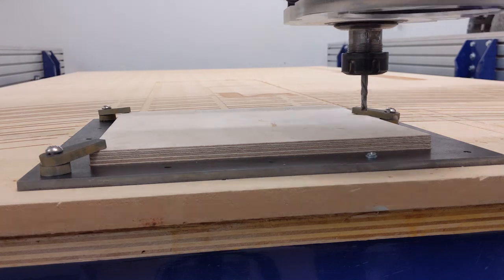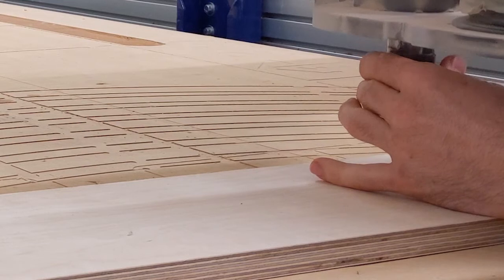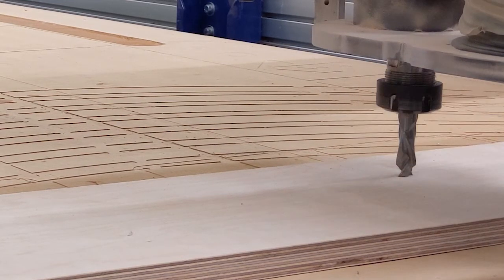For finding your XY0, adjust the position of your bit until it is above your XY0 location from your manufacturing workspace, then in software choose 'Zero Axes X and Y.' This position can usually be less precise than your Z0, since you should be using stock that's larger than your part anyway. For very small bits or very precise XY zeroing, proceed manually — very slowly lowering or inching the bit sideways until you can no longer see light between the bit and your stock, inputting numbers in progressively smaller increments. Once all positioning is complete, you must close the manual movement window — if the yellow window is open when you go to machine, the spindle will start and then the program will exit and stop.